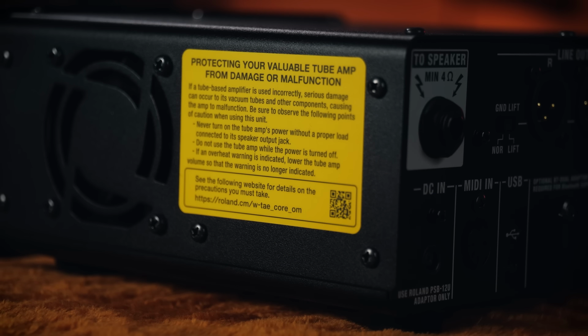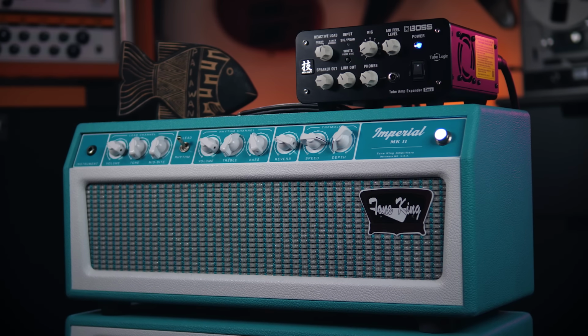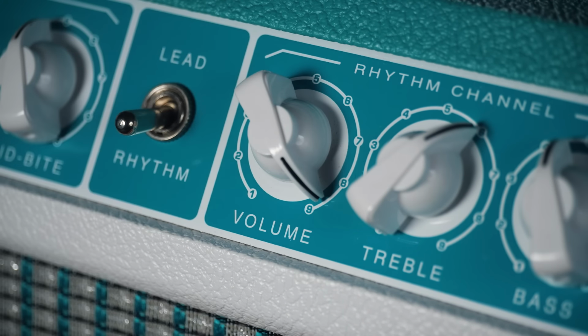The hotter it gets, the less power it's able to handle, and very quickly we'll find ourselves in a situation where your very loud valve amplifier is essentially running without a load attached, which will very quickly take down the amp. Attenuators are great for bringing down the volume of a loud amplifier to something more reasonable, but they don't provide you immunity from abusing your amp and thinking everything will be okay. So you've got to be sensible. Remember that running your amp at high volume levels puts strain on the amplifier and the attenuator. A Loadbox or attenuator is not going to damage your amp, but mistreating your amp certainly will.